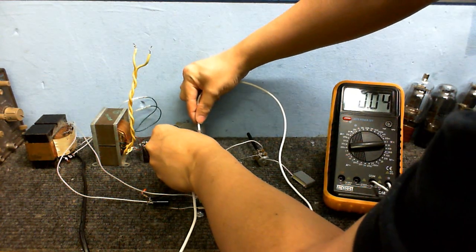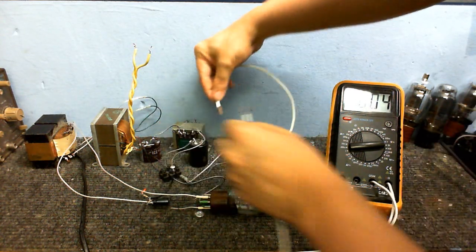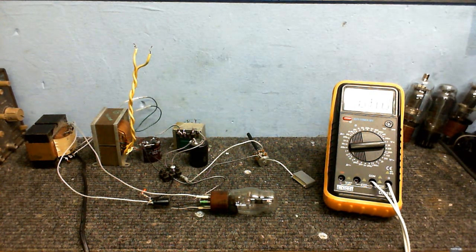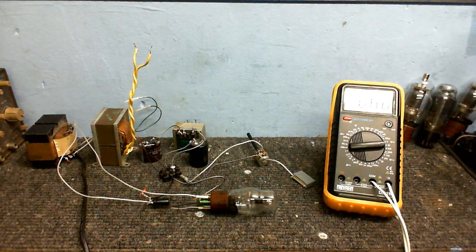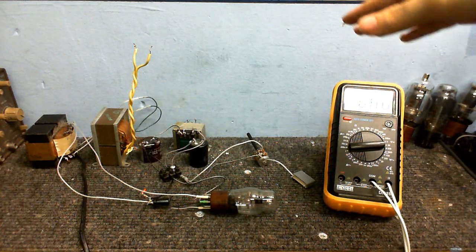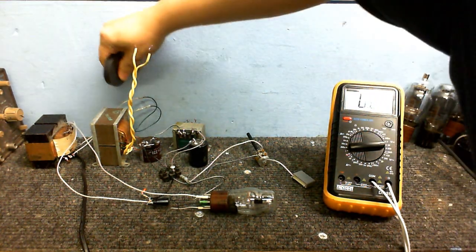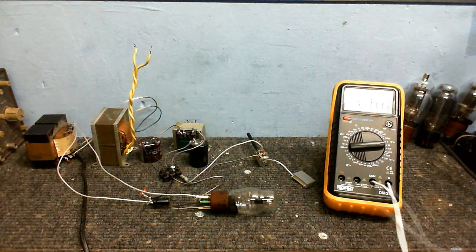Well, what output voltage is this doing? Okay, I don't think my power supply is working. I don't know if there's some problem with the connections in these two transformers. I don't know if maybe this has gone open somehow, or quite what is going on really. I was jiggling these wires about, making them a bit neater, so maybe that's the problem. I'm going to go through all of this, one by one, trying to find out what the problem is. I think the first thing I'm going to do is take a magnet to the transformers, make sure they're working. Yep, that one is on. And this one appears to be on, because I can feel the magnet vibrating. So somewhere along the circuit we are just not getting power.